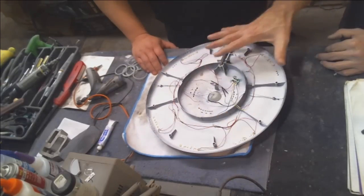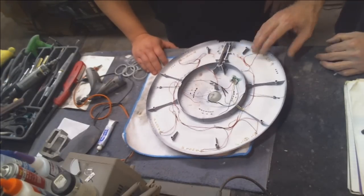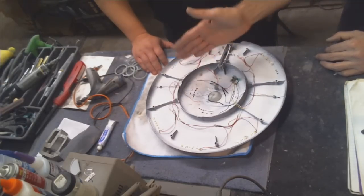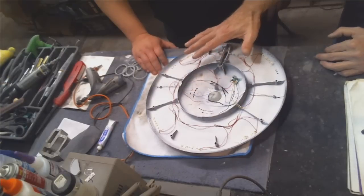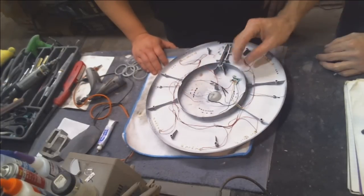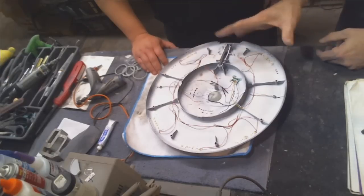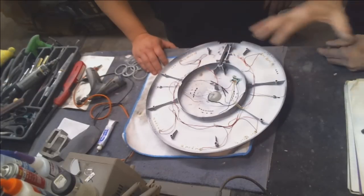He's learning how to clean all the wiring up and go back and check to make sure all of his connections are good. That's an important thing that he was talking about as well, the method that I taught him: every time you make a connection somewhere, you solder at that point in time. Because if you make 20 connections around here, you could miss one of them. Maybe it's making a connection now because the wires are twisted together, but over time, if it's not soldered, the model shakes a little bit, you could lose the connection, and out go the lights, or out goes whatever was hooked up to that. So it's a good rule of thumb to go around and do that. That way you make sure you don't forget anything.